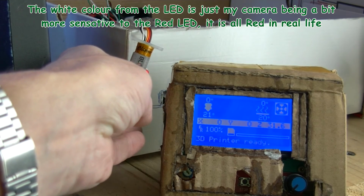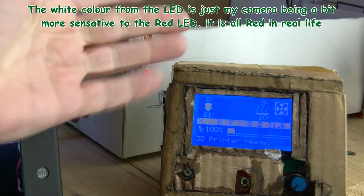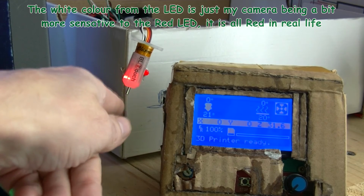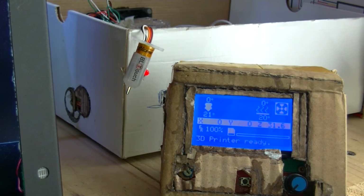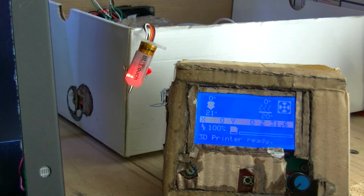And now I think it's gone into the warning because I've been knocking the switch a bit. Okay, and I can turn it off with S160 in Pronterface. I'm just sticking the S160 at the end of the command. Okay, that's reset the sort of alarm thing there.